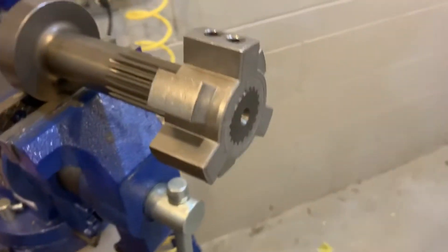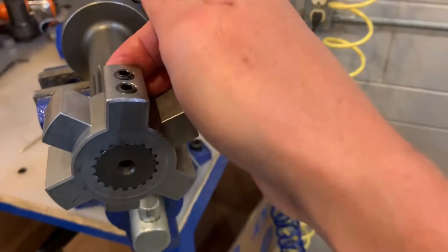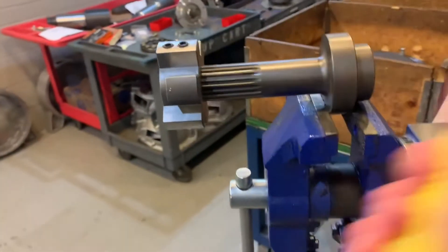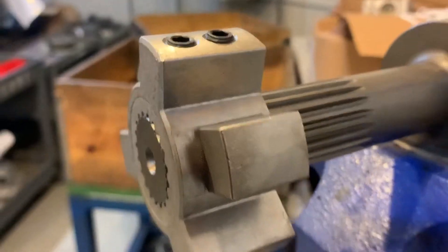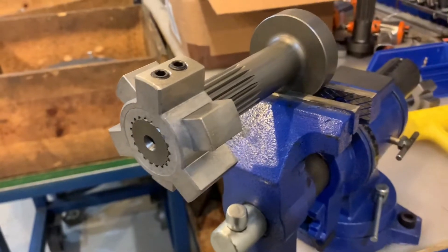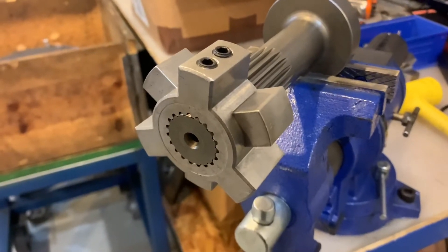One more thing I'd like to show you: I have now loosened these set screws after pounding on that hub, and still we cannot remove the hub from the shaft. Many times even with a hammer or a crowbar we still can't remove it. This is intended for one-time use — once you install it, you leave it there. If you ever have to pull this hub for service on the pump, you're going to want to get a new hub and replace the one previously installed. I'll have to go to our hydraulic press to get this hub removed before my next example.